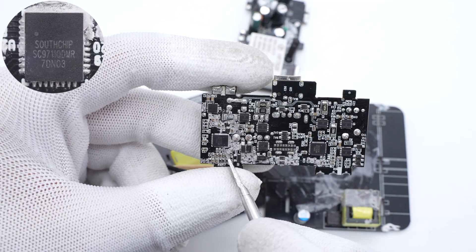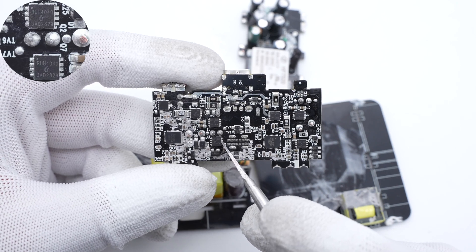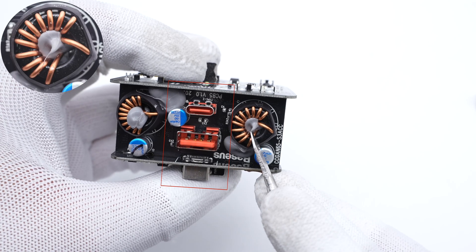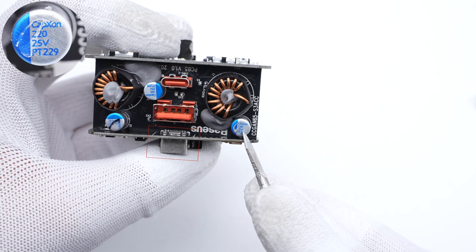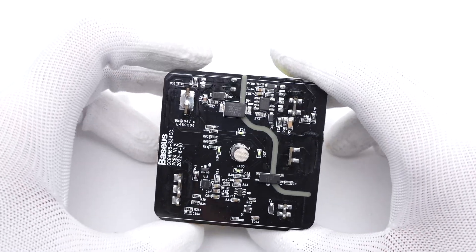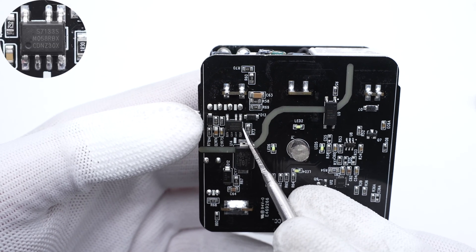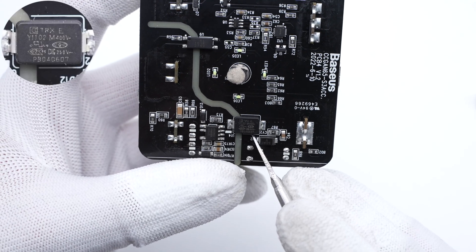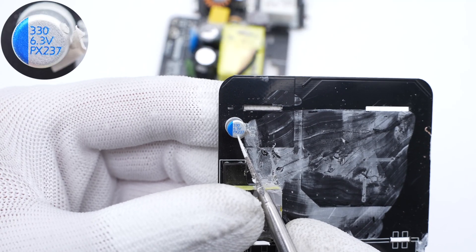A single chip can support the fast charging of a USB-C and a USB-A. Those two synchronous buck MOSFETs are from Rechips and adopt PDFN 3333 package, RDS(on) 5.5mΩ. Flip to the front: two USB-C and one USB-A connectors are between two capacitors and two inductors. This USB-C connector is connected to the retractable USB-C cable. The output VBUS MOSFETs are the same as the synchronous buck MOSFETs from Rechips. Here is the top PCB with a touch sensor in the middle. The buck IC is from BrightPower Semiconductor and adopts SOP7 package. The sticker shows this transformer can support an output of 5V, 1A. And the SMD-Y capacitor is from TRX.